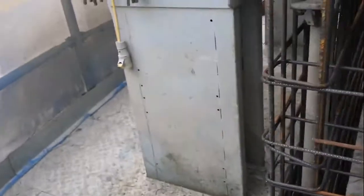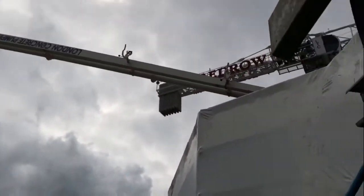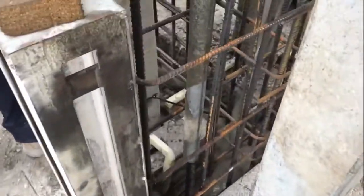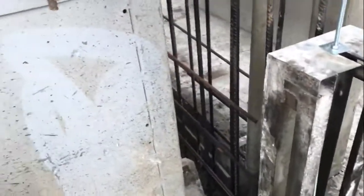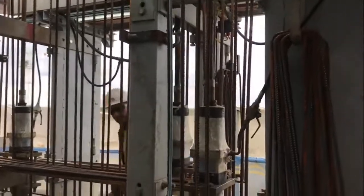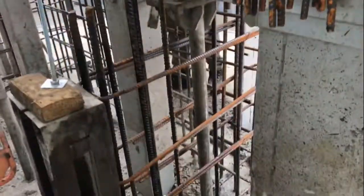It's very similar to what I showed you - the guys are pulling the concrete. You can see the pan running and the guys pulling the concrete - that's how it looks. The shutters are nearly filled. After the shutter is filled, everything is going to be vibrated properly. After some time the guys start to lift the shutters. You can see the fixtures working, and all the hydraulic jacks - the pipe is there as I explained before.